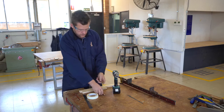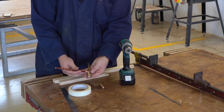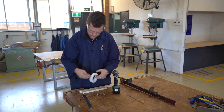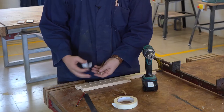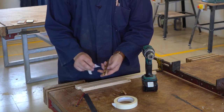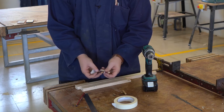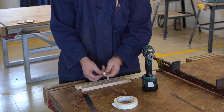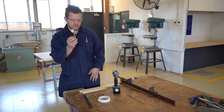All we've got to do is put our dowel up against the drill piece and mark out roughly halfway. With that tape, we make a little flag on our drill piece — sit it there like that, make sure it's straight, and then wrap that tape around the drill piece, leaving a little bit sticking out. That is the depth we then need to go to.